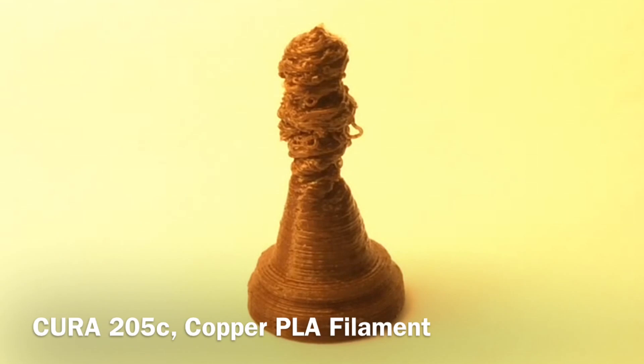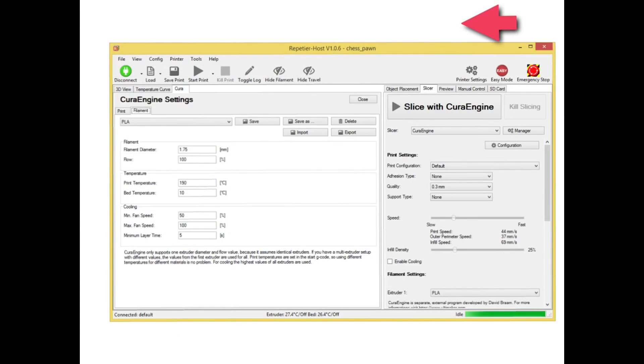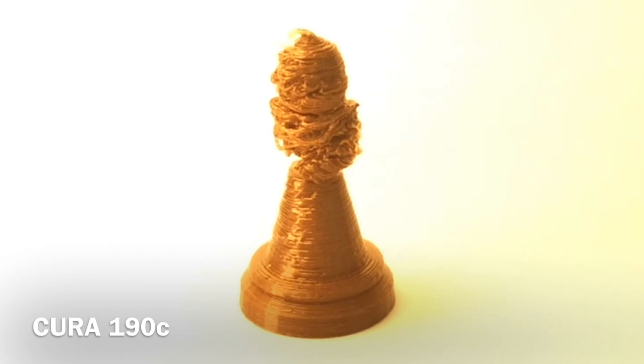And here's proof. I printed this on my DaVinci that's reflashed with Repetier and sliced it with Cura, and this was the result of a very bad print. So I decided to try a lower temperature. I went to the configuration button in Cura, then to the Filaments tab, made sure I had the PLA listing, and set it to 190 degrees C and ran it again. A little better at the base but the top was still really bad.